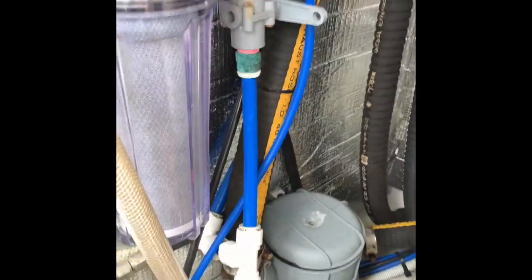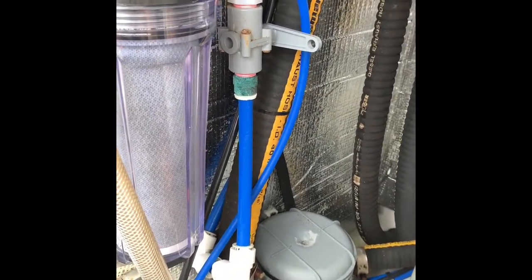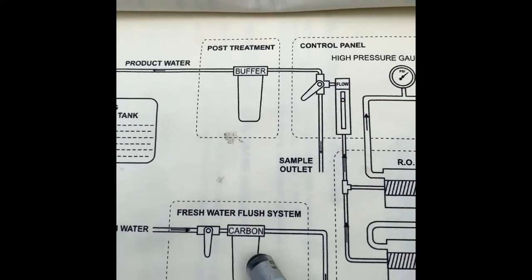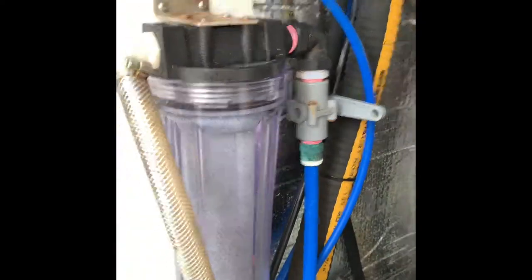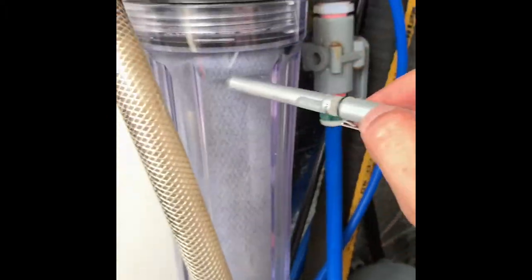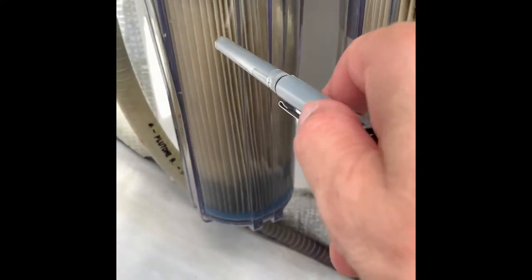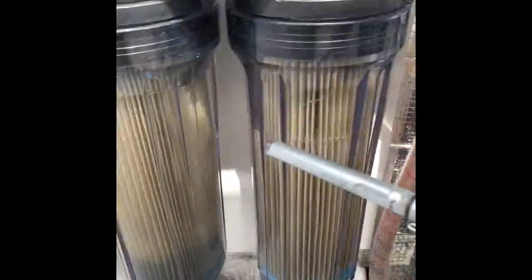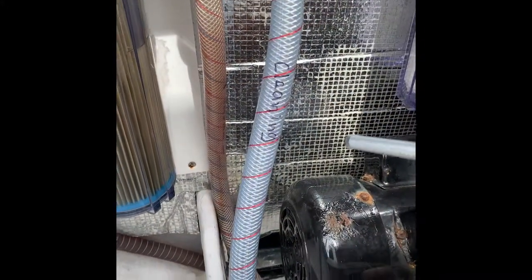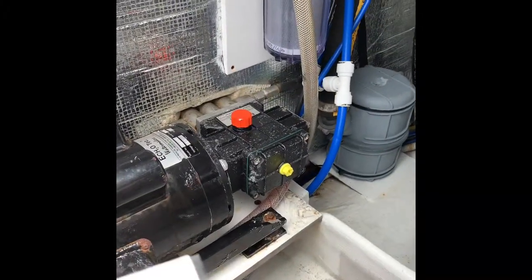You do the flush here. The blue plumbing is the water supply from the boat's water tanks, and it brings fresh water through here — that's our fresh water shut-off valve. Here is a carbon filter that was also replaced. When I open up this valve, we're now pumping fresh water from the tanks through the carbon filter and into the pipes. It comes through the 20 micron filter and 5 micron filter, flushing out all that sea water.